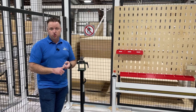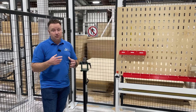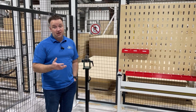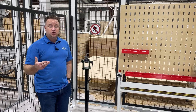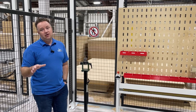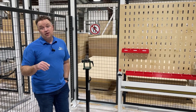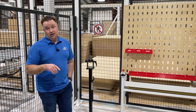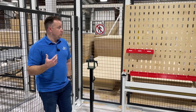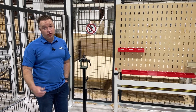Our bits — we mostly use the Onsrud bits. We actually buy them through our partner at Advanced Machinery. We like the Marathon Coated bits. We've found, going to the trade shows, it seems like there's about 300 bit suppliers and every one of them wants you to try one. When we first started going to those shows a number of years ago, we would try them — they're 10, 15 bucks less than what we're paying, so let's try one. But we found none of them lasted nearly as long as these Marathon Coateds by Onsrud. We really do get 300 sheets of melamine on a two-flute Marathon Coated bit. It's pretty amazing what they'll do. So we keep them in stock at each machine. We don't vary from that now — we just use those because we know they work. They don't break.